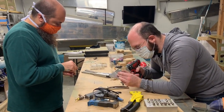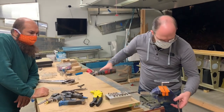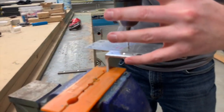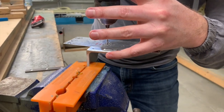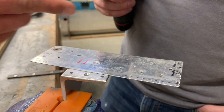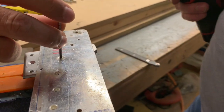We're going to try to be as straight on there as we can. It's usually not a bad idea to put the part in the vise — it's just easier. It's not always possible if this is on a wing or something. You're not going to go too far. I just took a little bit off so far. Will it pop off? If you do it perfectly, right down the middle, it will just pop off and come up the drill bit. I wouldn't bet on that though. So I'll do it a little bit and then take the same size drill bit and see if I can fit it in the hole. And I can't — so you need to go a little bit deeper.